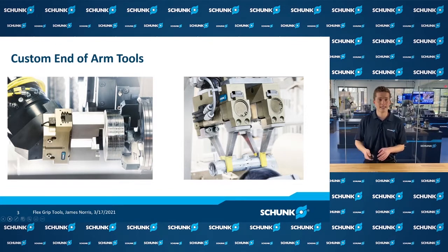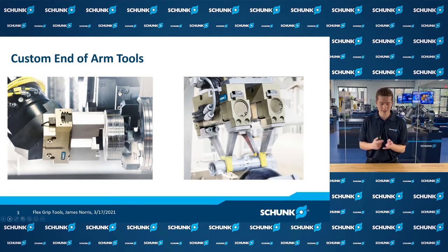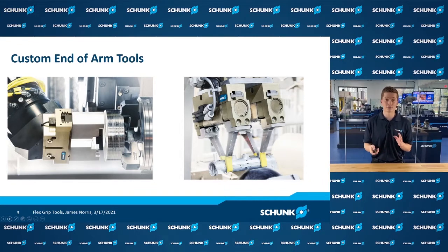This other example is a setup where you have a custom adapter plate back to your robot wrist that allows for the mounting of two separate grippers. The two grippers are used to grip onto this piece with a custom set of fingers, as well as hose-free and direct electronic connection for the sensors. So here we have a custom adapter plate, custom fingers, and two grippers — which just takes time to design and set up.